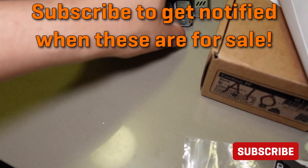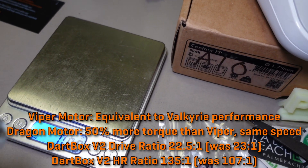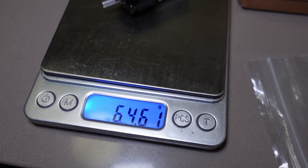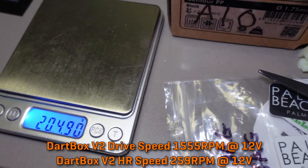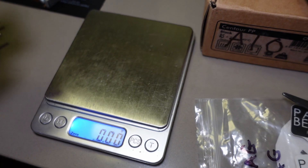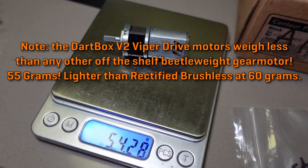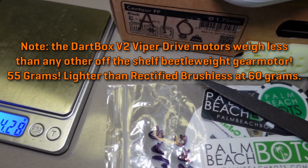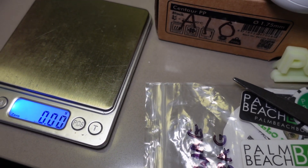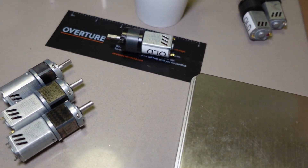You can see here this is a Kraken motor on the standard drive gearbox — 64.6 grams. And then this is the slightly lighter motor, but it's only a two-gram difference, with the squared-off ring gear — 54.28 grams. So about 10 grams saved, which is pretty significant. It's about 20% of the weight of the gearbox, and there's absolutely no reduction in performance.